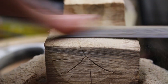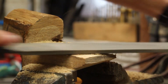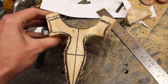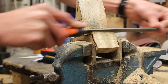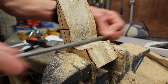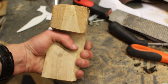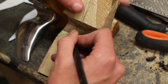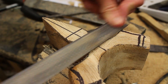I found that hand rasps are the best way to shape something like this since it gives you a lot more control over how much material you're removing than a belt sander. With a belt sander it's a lot easier to go over the lines and go too far, but hand files and rasps are a lot slower. At this point I've roughly got the overall profile of the slingshot handle in one direction and I want to turn it 90 degrees and get the rough profile in the other direction. For this I'm going to be carving in a palm swell and a groove for all of my fingers — you can play around with this shape and geometry.